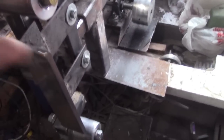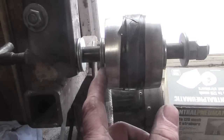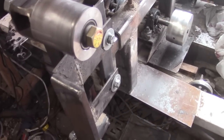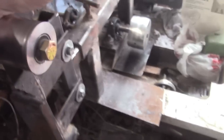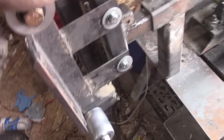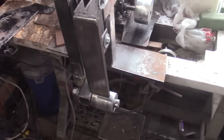After messing with it last night — adjusting, readjusting, shimming — look at the tracking wheel and how I've got it shimmed out. This is the only bolt I had so I had to put shims on here to get the nuts to fit. I moved the drive wheel over a whole inch. It was just a whole ton of playing and fiddling, but I got it all done and the thing works better than ever. Last night I was questioning why I did this when I need my shop in perfect working order, but when I finally got it working right it's working right, and yeah it's still ugly — still a heap of a grinder — but she works perfectly.